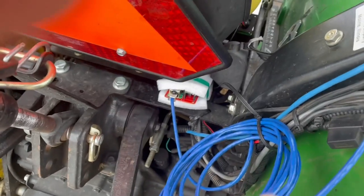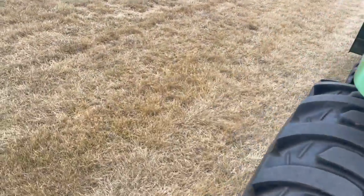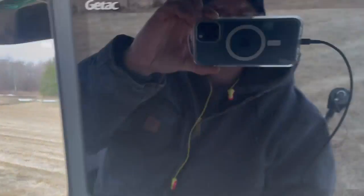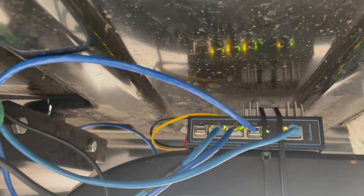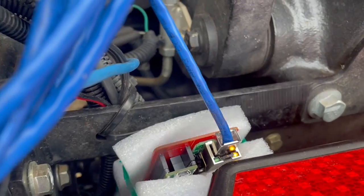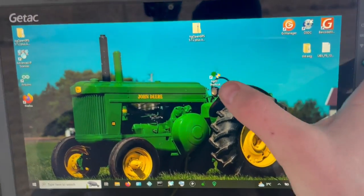Everything is set to the 192.168.5 network. We'll just power it up here with the engine off so you can hear what's going on. We'll power on the laptop — it is cold, sorry if I'm shaking. Troubleshooting on POE is really easy because if you have blinking lights you have something alive at the end of the switch, so you know you're at least getting power and data moving to the different modules. And every module also has a blinking light, so you know exactly where everything's going.